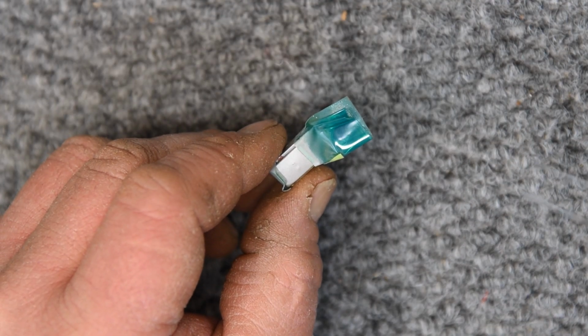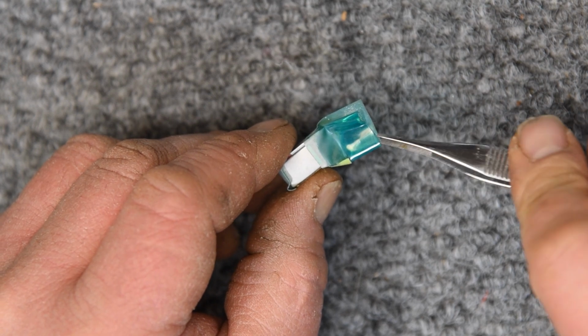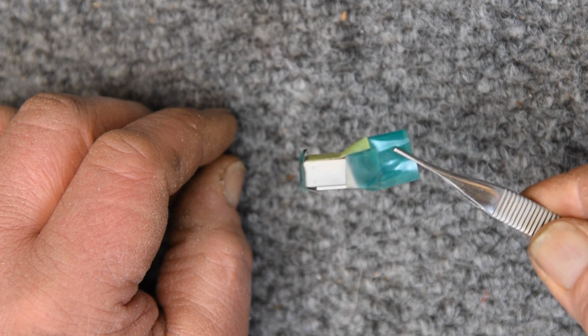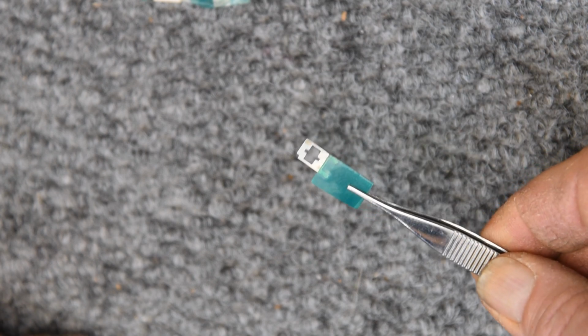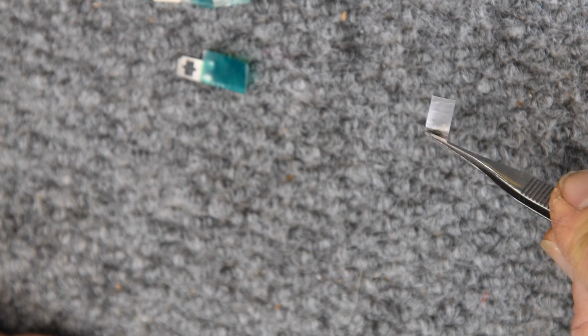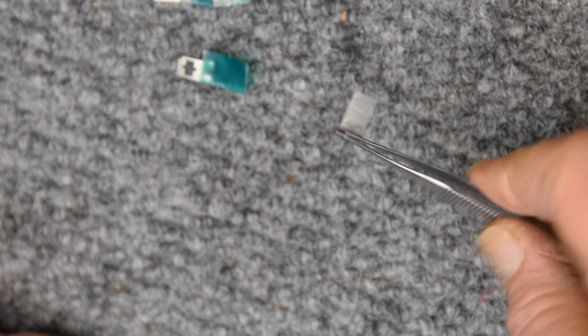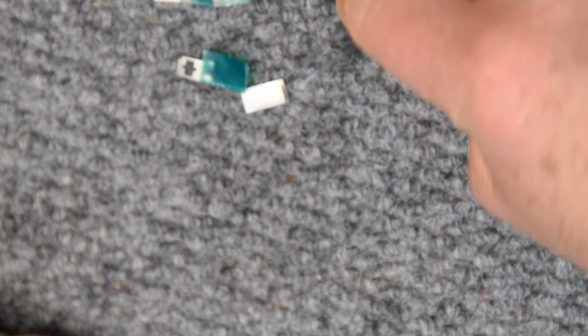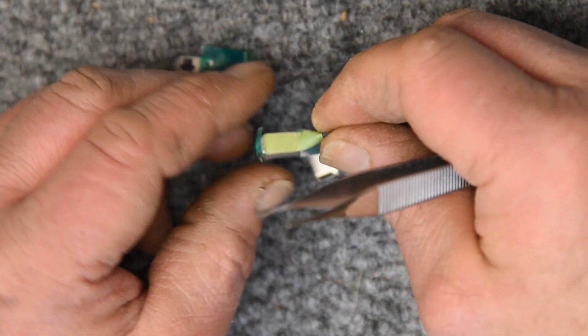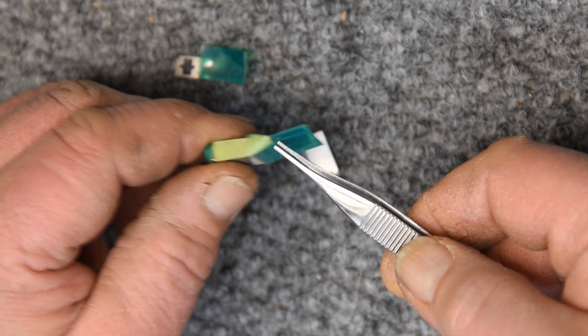Now on to bonding the guide and the shield back onto the repro head. The accepted standard for bonding ferrous metals to each other, or even brass or copper, for example, is bead blasting. There are other acceptable methods, but bead blasting is the preferred one. And then the other part of this is bonding it quickly after the bead blast. That's the reason the guide fell off so easily from the 5-minute epoxy, because that is not an acceptable way to bond these two materials.